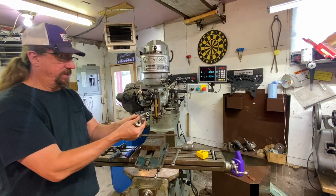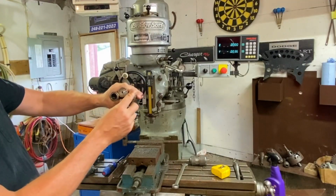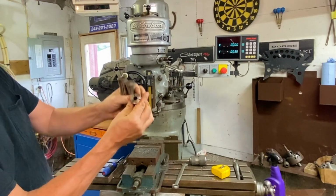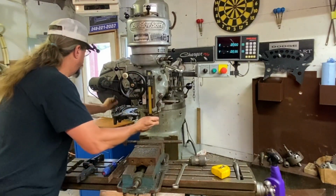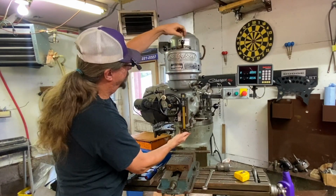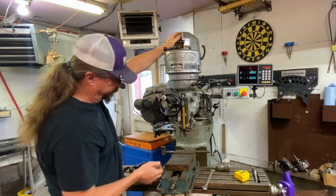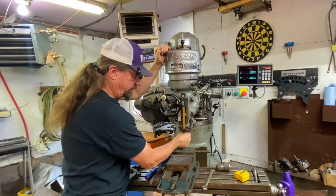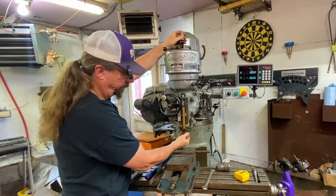Again, there are these tapers. Oh, I got to get this stuff cleaned up. And they have different specific sizes, and when you tighten them down in there like this, this squeezes these together and grips onto the tool. So you put your collet in here like so. Spin down your thingy bob, okay, and then you get your tool in there if you have one that's that specific size, and then you put your brake on, put your wrench on that, and you tighten it down so that tool stays in. You release it, and then you should be good to go.